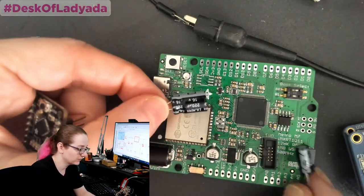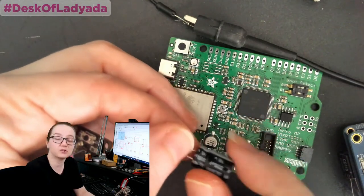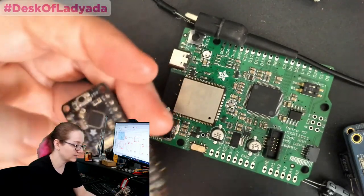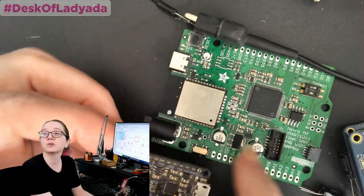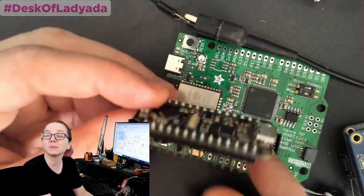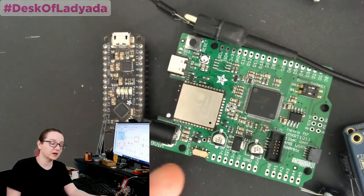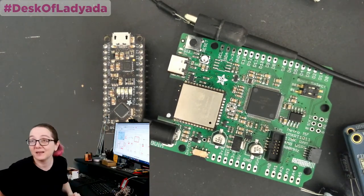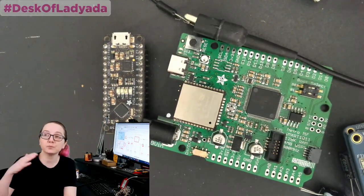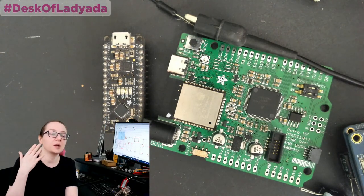They're large — they don't come super small. They are actually wound pieces of foil inside that create the capacitance. Compare this board which has two electrolytic capacitors to a board like this which has none — it has only ceramic capacitors. Why do you want electrolytic? First, if you have the space, electrolytic capacitors offer much better cost per capacitance.